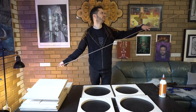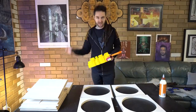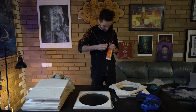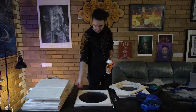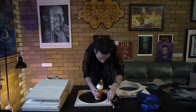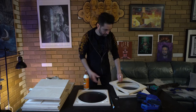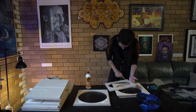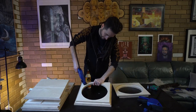I'm getting the dowels prepared. The inner baffle and outer baffle glue together but also use dowels to keep them in place. Here I'm about to start gluing — just pouring a bit of glue in the holes and sticking the dowel in. I use a brush to spread the glue out evenly, and then clamping to hold the force down, wiping away any excess glue.